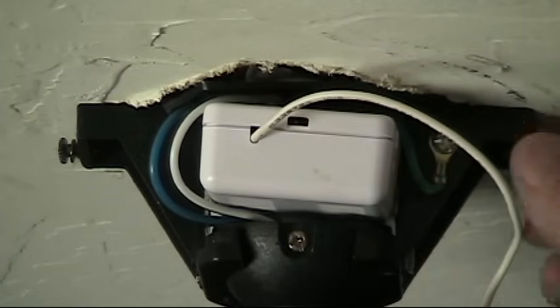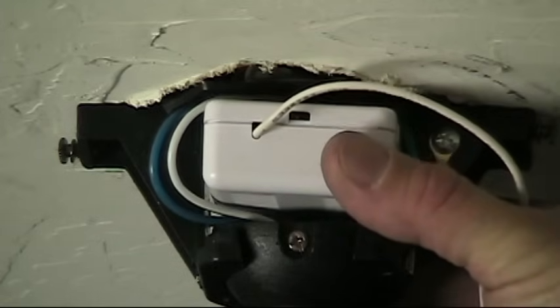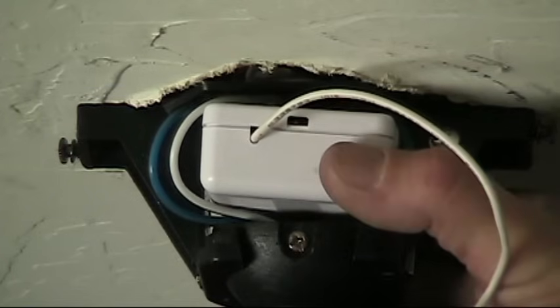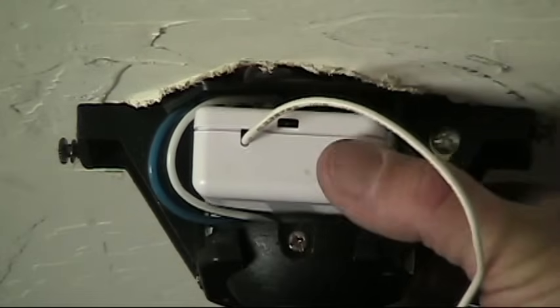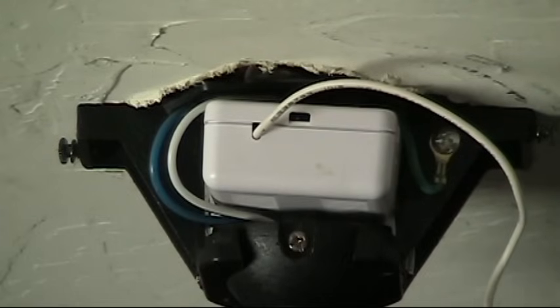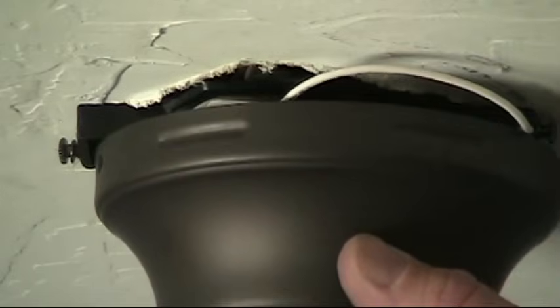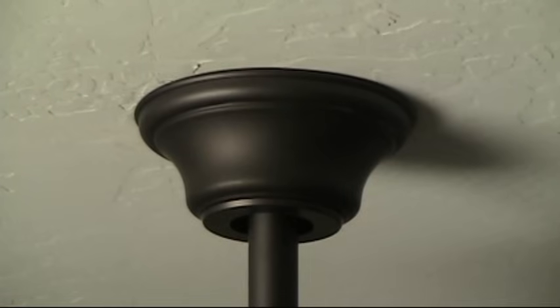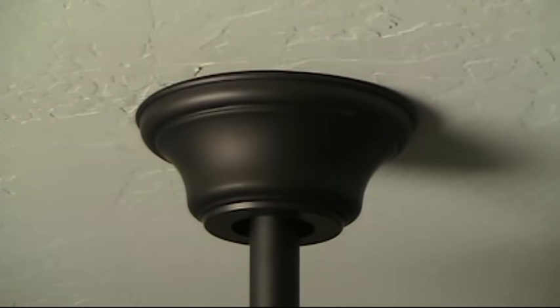Here's the remote all tucked nicely in place inside the canopy. You need to make sure that your splices are poked up nicely into the outlet box and that no wires are pinched, because there's not a lot of room to work with. Have that receiver unit tucked up nicely in the bracket — not too tight, nothing being pinched, nothing in the way when we put the canopy back. Tuck the antenna wire inside the canopy, then put the canopy back up and the trim ring in place. Here we are with the canopy reinstalled, all four screws in place and the trim ring back where it belongs. Now we'll go do the work on the switches and blank off the switch that used to be the light control, just so there's no confusion.